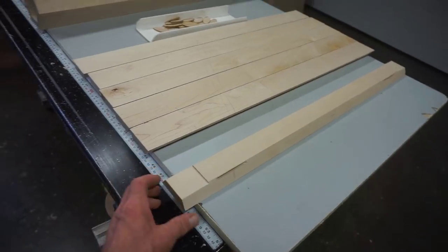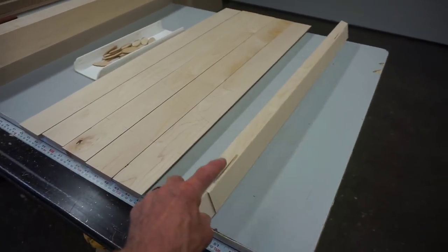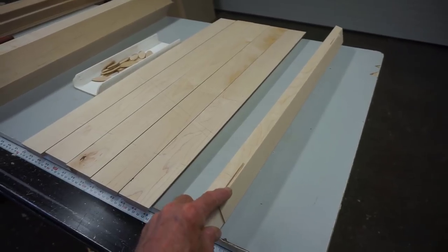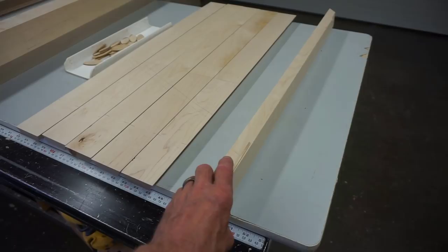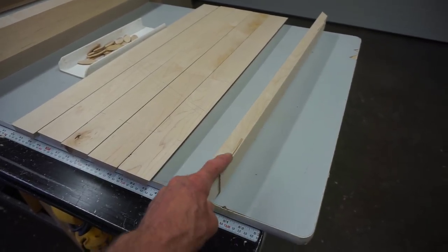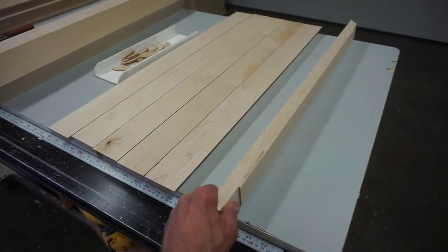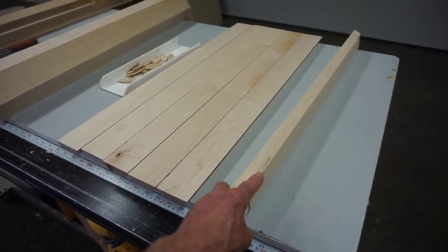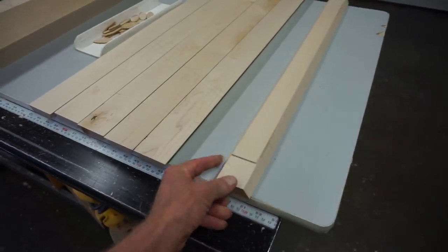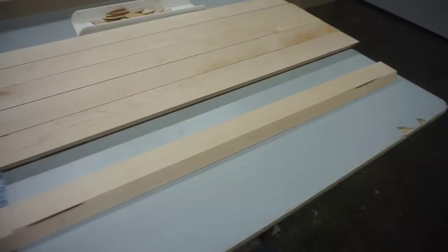In each one of the slats, I've made very accurate bevels, and then each slat has two biscuit joints in each side of it. These are put very near the short angle of the miter so that when the hexagon is turned to a cylinder, it doesn't cut into those biscuits. The biscuits are a great help when it comes to clamping because they easily keep these slats aligned as the clamping pressure is increased. I also rabbeted a small shoulder in each end of each slat.